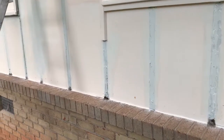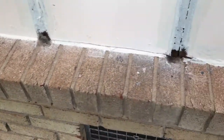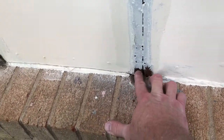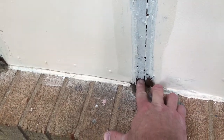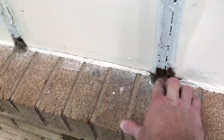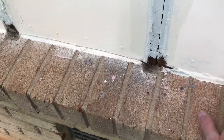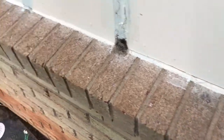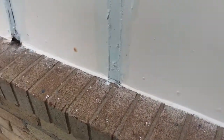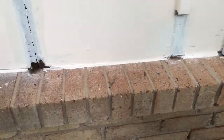We're going to start with our six-inch piece of PVC that goes down here against this area. As you can see, our masonite here has a little bit of wood damage at the bottom, which I knew was happening because all these years it's been sitting here with water right up against the brick. Even if it's caulked, if there's a little crack, water can get up underneath there or wick up as well. That's why we're cutting all these back.